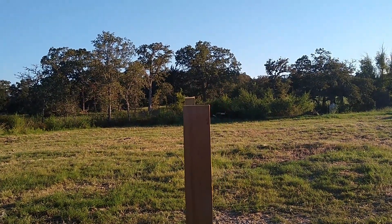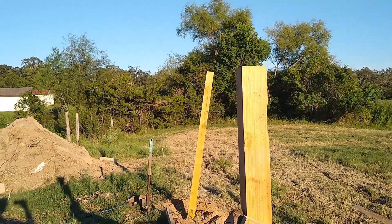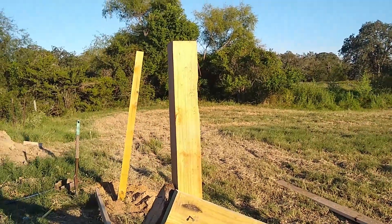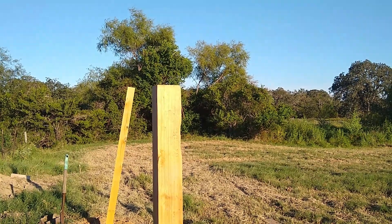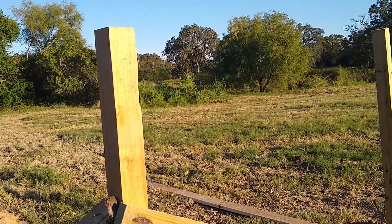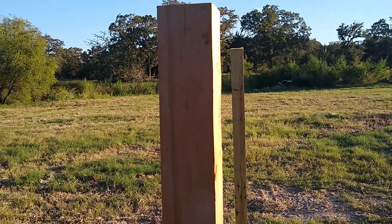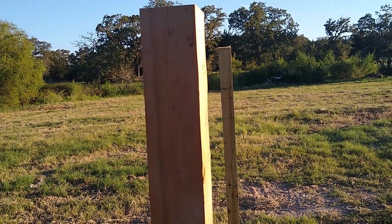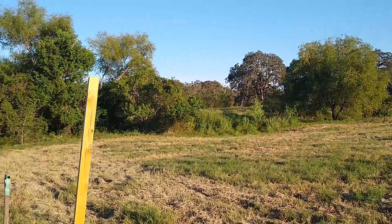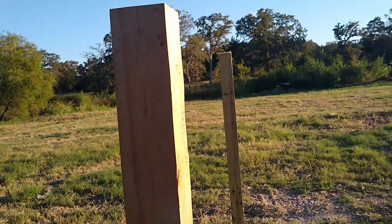South is that way. So what I'm going to do is put a post every 12 foot over there and over there. So that will be one section. I'll keep going from there. I'm going to use 4 pieces of unistrut on each section, going across that way. And the panels are going to mount directly onto that. It's going to be a 12 foot 2 by 6 going across here, and an 8 footer going across this way on each section — give it some stability.